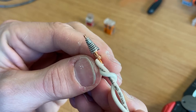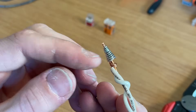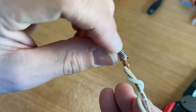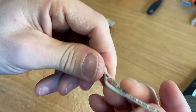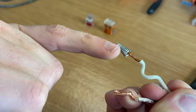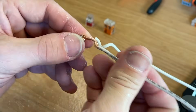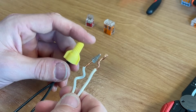What's happening is that the solid core is actually going through the threads of the wire nut — this is what's internal to the wire nut if you take the plastic off. The strands are really just kind of snaking around and only getting one or two rotations. So if you undo that, in the pull test the strands will pull right out, even though the solid core is still held within the threads.